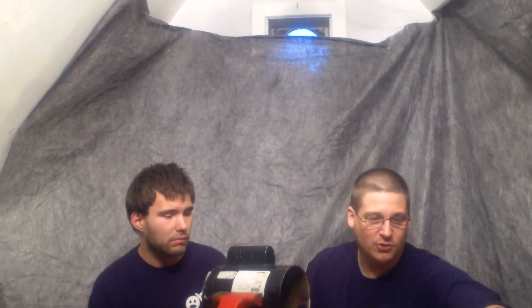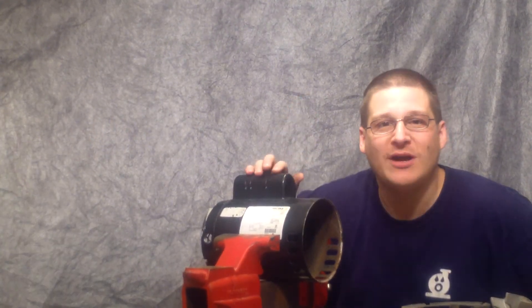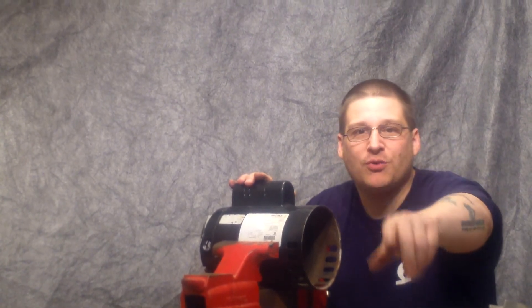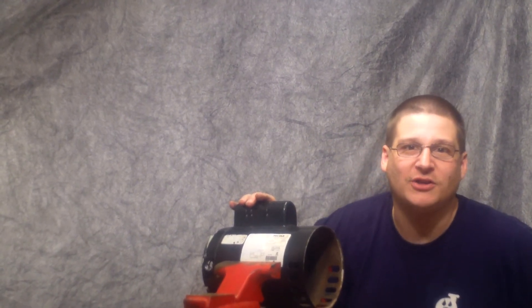We won't be changing the bearings, but if you do have a PAC-FAB and it's not fried, you can get two 6203 bearings, one for the front and one for the back. This is Joe Tamargo from wetheadpumprepair.com. If you have a PAC-FAB motor Challenger pump and you need to replace the bearings, the part number is 6203-RS-LL, available at wetheadpumprepair.com. Thanks for watching. Peace.